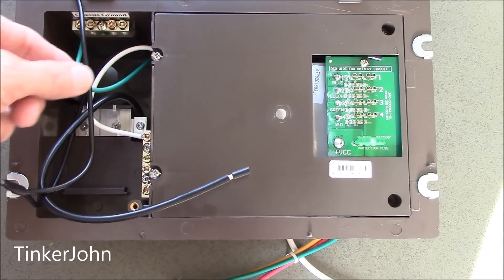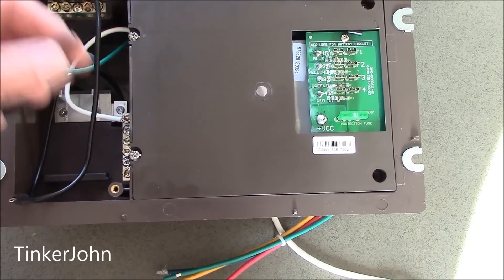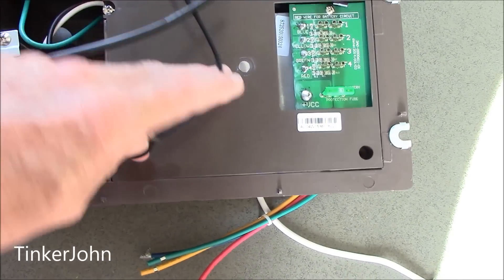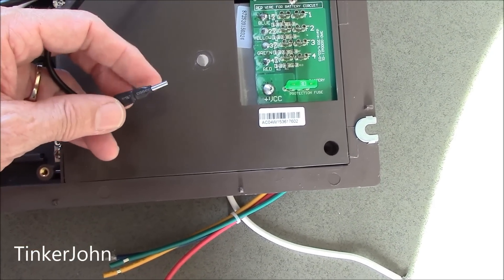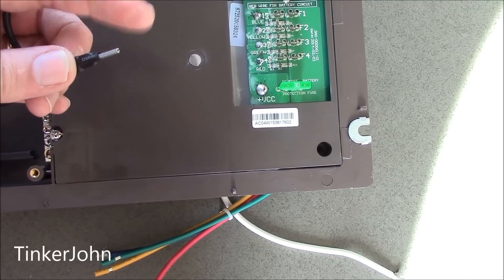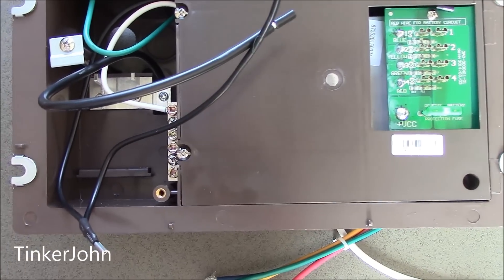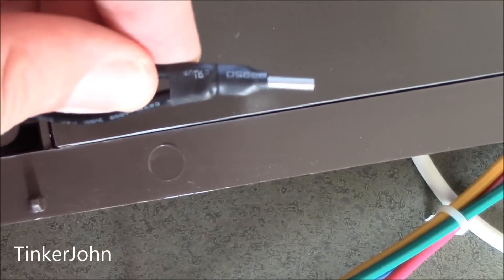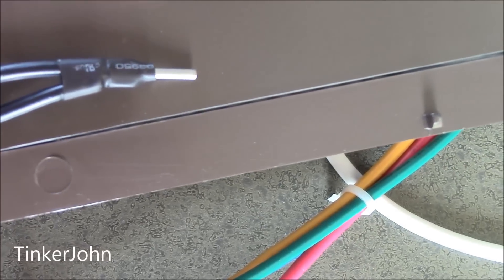Okay, what you're looking at is actually the front. There's a panel that goes on here, and I just took the panel off — this is how you get to the AC wires. Something's concerning here. This wire right here is just a junction wire that goes together, but if you notice, there's no insulation on the end of it. So I'm glad I took this apart. This looks like a piece of aluminum that may have been tying these two wires together — really strange.